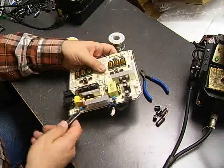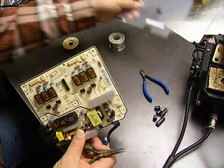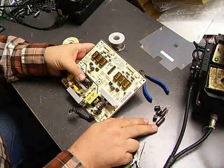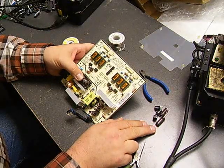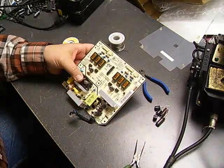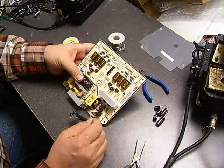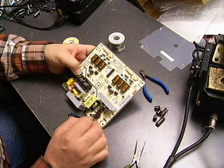To do the repair you will need to have good quality capacitors. They need to be low ESR, high ripple current, and high temperature varieties — not the standard types like you would be able to get at a local electronics place such as Radio Shack or Fry's, as they would not have the proper type. If you do not get the proper type, they can damage the integrated circuits and driver transformers on the board when they fail, and they will fail within a month or two of installing them because they're just not designed to hold up under the stresses of switch mode power supplies.